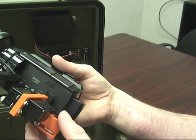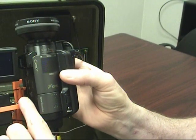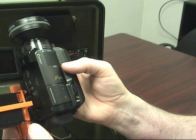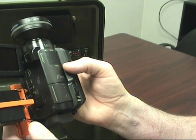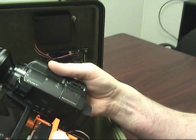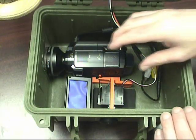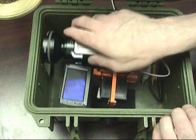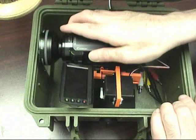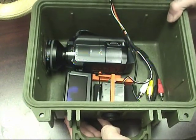The system itself is a three-axis setup. There are three screws to control how the button is pressed for the night shot control. We recommend you set this up at installation time to make sure it's set up right, because it's very particular to be aligned perfectly. The screws are easy to adjust, and once it's aligned the system should just stay in place in the box. The camcorder can sit on the bottom of the box, or you can use Velcro on the bottom of the night shot servo mount to hold it in place if the camera is going to be mounted at an angle.